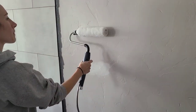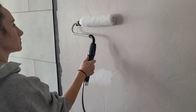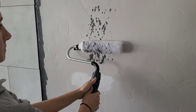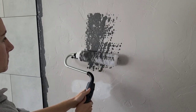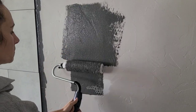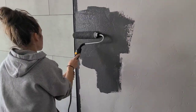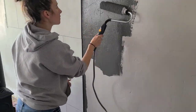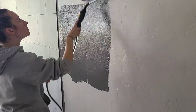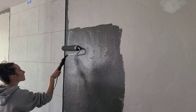Leave the machine powered on and keep rolling. It may take a moment for the paint to fully saturate the roller — at first it'll be a little patchy, then you'll see it fully saturate. Test on a dry part of the wall; if you can see any background color it's not fully saturated yet. Once it is, press the yellow button again to stop the flow of paint, and then simply use the roller to spread out what's already on the wall. I like to work in a W or M pattern, zigzagging across the wall.